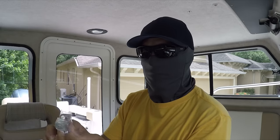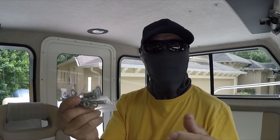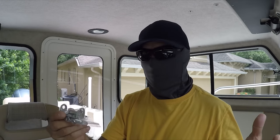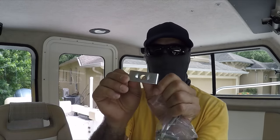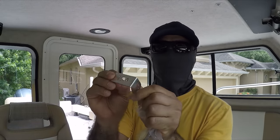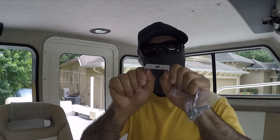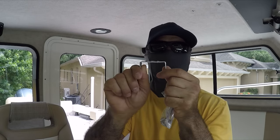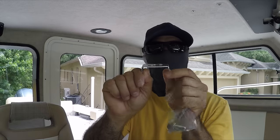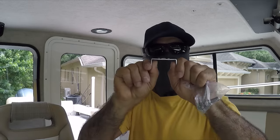The hardware is very sturdy — stainless steel brackets, very strong. You can tell how thick they are. All stainless steel, great for the marine environment. I'm about to install this light under the pulpit. What I'm going to do is instead of just one hole, I'm going to drill two holes on each side — one here and one here — so this light has more support, not just one bolt going through the pulpit. I've got two stainless steel screws going through each corner so the light is more sturdy.